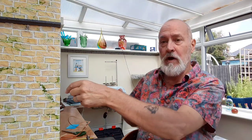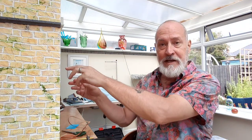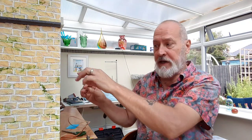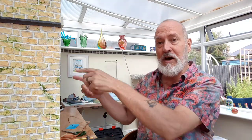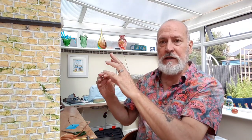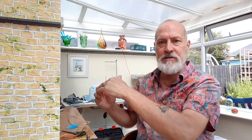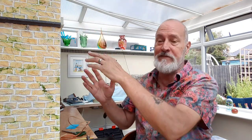And also, once I've put all this on, I'm then going to wire one light at a time and connect it to the connector and make sure that light comes on fine. Then I'll add another light and make sure that one's working, and I'll do them gradually, because if you wire the whole thing, switch it on, and there's a light not working, you can't work out which join is not connected, if you know what I mean. So if you do it gradually, then you can see where the first fault arises, if there are any. Right, let's get on.